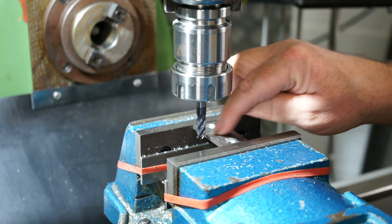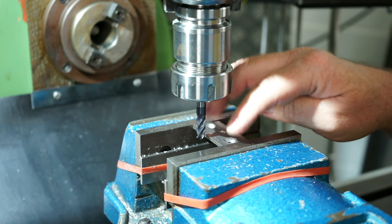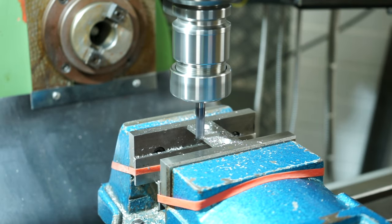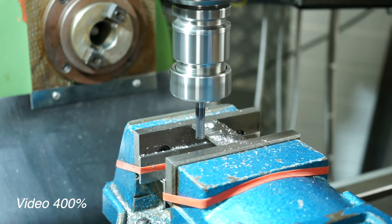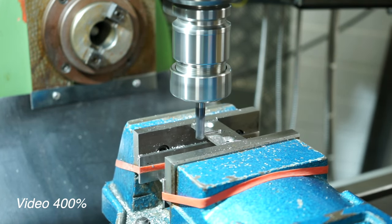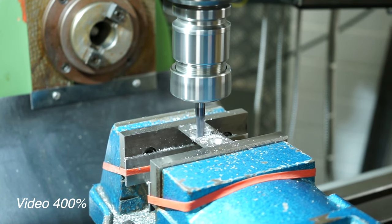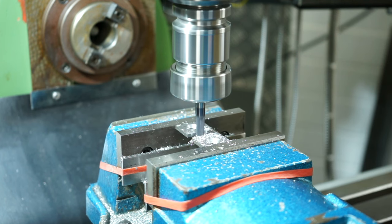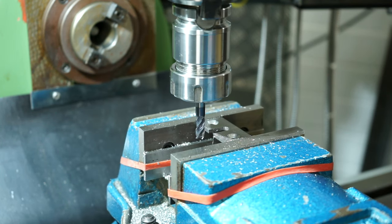What I need to do now is cut this slot — it holds the screwed shaft into the sliding jaw. I don't like holding it this way because as you tighten up it will bow. I would have preferred to make a little aluminium fixture to bolt this down, but I'm short for time. The material is 3mm thick so it's not held in there by much. I'm just doing half a millimetre depth of cut. I'm going to be real cautious — there's a little tiny corner holding it. Righto, I just got away with that.